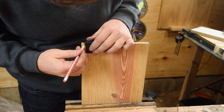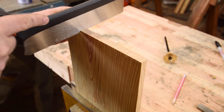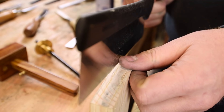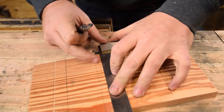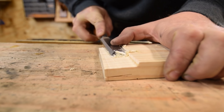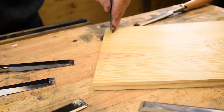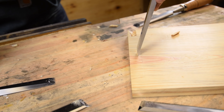Now that we're through the basics, it was time to try some joinery. I laid out some basic dovetails — nothing special, just to try clearing out the waste with the chisels. I used some ancient, really dry, splintery pine just to make sure I didn't have any fun. I also laid out some tenon joints to test how well the chisels could pare — just construction grade Douglas fir. Last but not least was some hand-cut dados, also laid out in that awful pine. I tried all these joints — actually several of each — with all the chisels. It was by no means a scientific test, but I wanted to get a feel for each of them across different joinery tasks: from chopping, to paring, to clearing out dovetail waste.